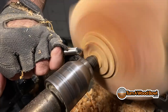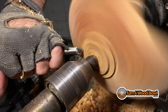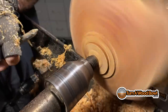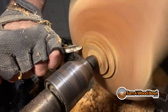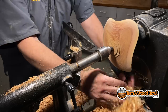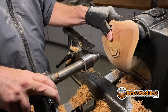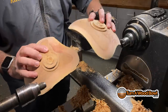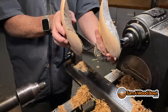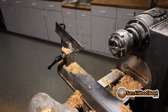The angle of the dovetails on my four-jaw chuck are about 11 degrees. After you've made a couple of these you can kind of eyeball it — it's just a slight inward push cut on the side of that tenon. Then I want to clean up that shoulder and make sure it's nice and flat. And now we have two bowls with the exteriors complete, tenons created, and shoulders created as well. We can move on to the next step: removing the interior of the bowls. That's the profile I'm looking for — a really nice smooth curve on the exterior of the bowls.